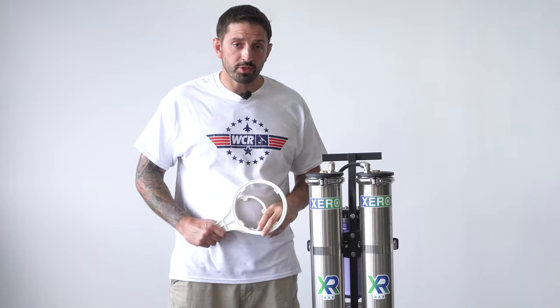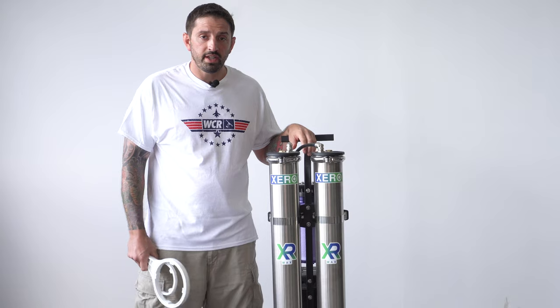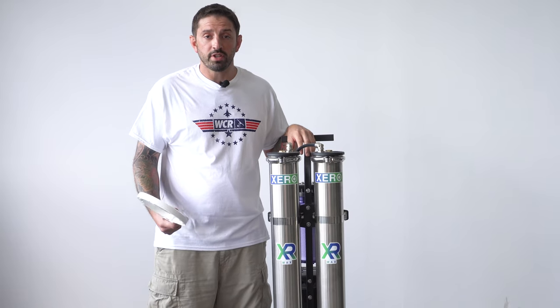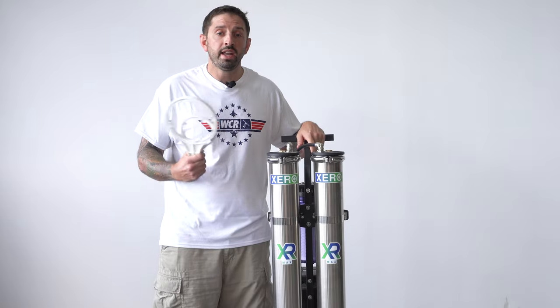Let's talk about filter changes with your XERO Pure Revolution MAX RODI system. The RO membrane in front is probably going to be the most infrequent filter you're going to change, at every 2 to 3 years. So in this video, we're going to talk about the pre-filter and the DI.